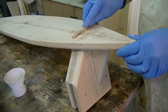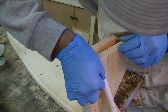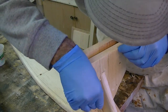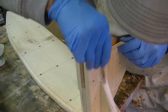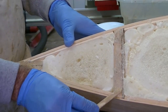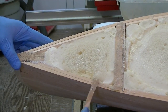I filled in with epoxy and filler over the countersunk screw heads. Using a popsicle stick, I filled the joints of the post and the braces to help the fiberglass cloth bend around the joint and make the post stronger. I used the epoxy and filler to glue the deck to the hull, then after screwing down the deck, I used it to fill the countersunk screw head holes.